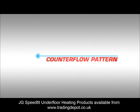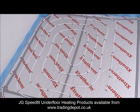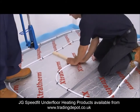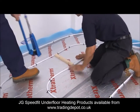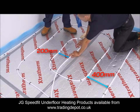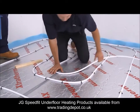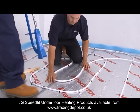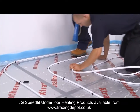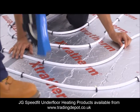Counterflow pattern. This is an example of the counterflow laying pattern. It may at first seem more complicated but it's often easier. When installing counterflow, the pipe is laid and stapled in a spiral pattern, moving into the centre of the circuit where a double return is performed. This means that the initial circuit has to double the design distance apart. It's usually easy to install the returning circuit in the centre of the pipe work runs by eye. Then the pipe work is laid in the opposite direction, spiralling outwards from the circuit centre and between the incoming pipe circuits. The pipe work is run until the circuit is finished.